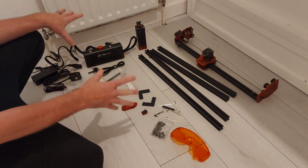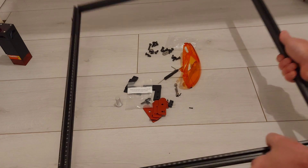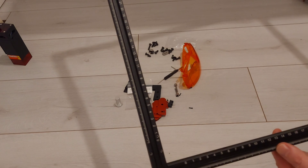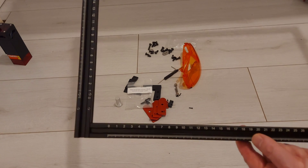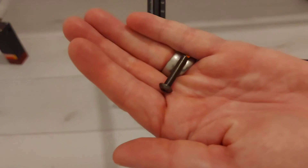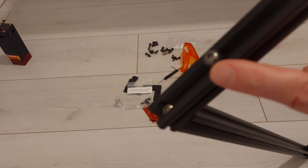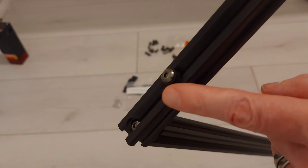Let's see how easy it is to assemble and get it working. The first thing to do is assemble the frame. It's easy to work out which piece goes where — you've got the two sections on the front and left side with the scale on it. You have got to be wary of which way round you put the rails because there are holes for the feet etc., so just make sure you orientate them all the right way. The front and rear go inside the side rails and you fit them together using a 25mm screw in each corner. On the back you've got this piece — one either side — and that's basically to stop the X-rail sliding right off the back, so make sure these are positioned towards the back on both sides.